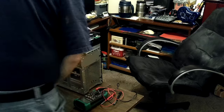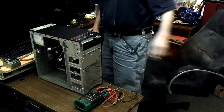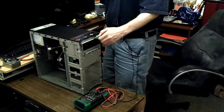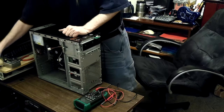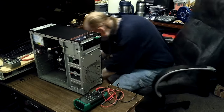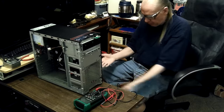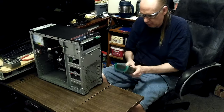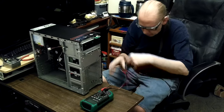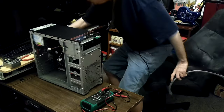I sort of just bumped that button — that might excite me so much I'll fall and tangle up my feet. Let's see — I figured. This other power cord I'm sure is good because I did test it — it tested hot with the multimeter. Sometimes the wires are broken inside and you don't know it, they're intermittent, or they don't make good contact with that particular female connector. It's always good to try a different cord.